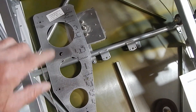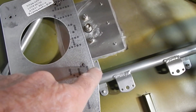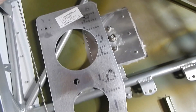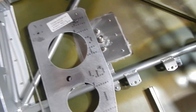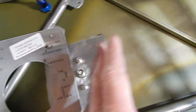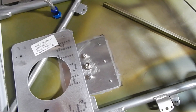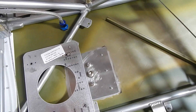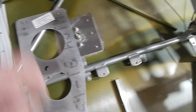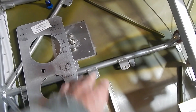I placed the fuel pump mounting tray into its place and I'm going to have to move it about a quarter of an inch to give my antenna enough room to plug in. I actually got lucky — I'd randomly placed that by eye. There's also a servo plate coming down there, but it has some room and I can notch it if needed. For future builders, I'd recommend waiting to put your antenna mounts in until your fuel pump, servo, and header tank are installed. A probably better location would be back behind the cage bar rather than in front.